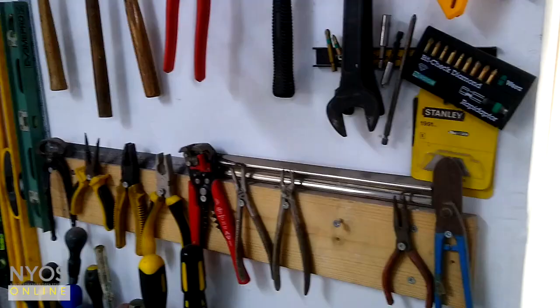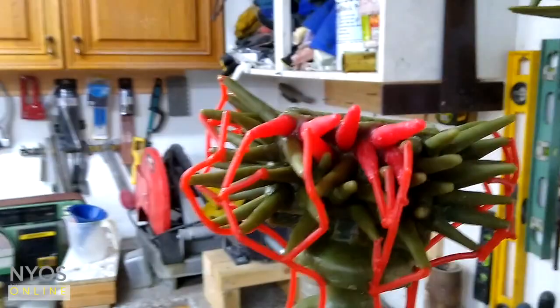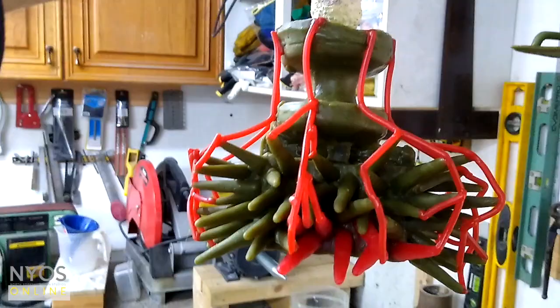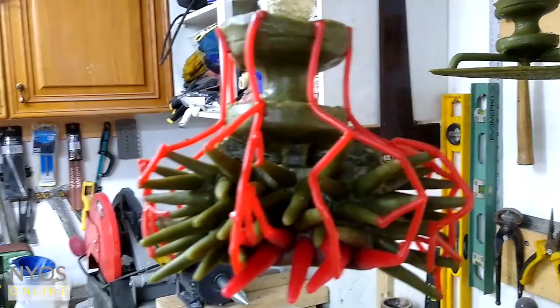And then this one, kind of spiky hollow feature. It's a bit difficult to explain what this is going to be, but hopefully I'll have it on my Facebook and or Instagram page soon. You'll see this one I actually want to fully cast, so all those waxes that point upwards would normally trap air if I didn't sprue them up like this, so all these thin sprues allow the air to escape from the mould.